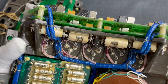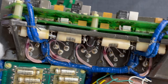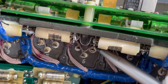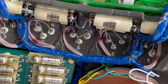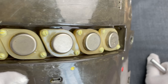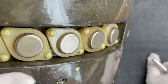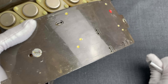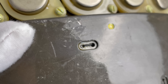A very interesting part in those connections is what you see here — those are transistors from NPO Electronics, Voronezh. The markings should be very familiar to anyone with basic electronics knowledge: E for emitter, K for collector, and this one — Baza — is the base. What makes those unusual is that they are externally mounted. Mounting them this way was a common Soviet military practice to provide better heat dissipation, easier testing and maintenance without having to open the entire unit, and isolation from other components. Notice those slots too — they have tiny cable straps that hold the cables inside together.